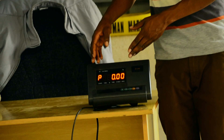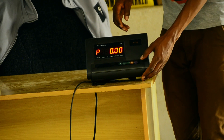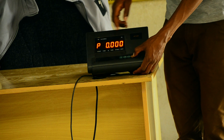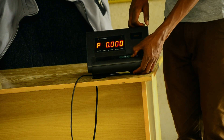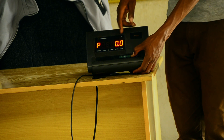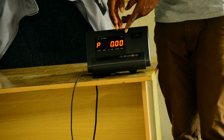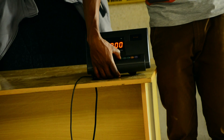This gives you the number of decimal points that you want. You can change this by pressing the tare key. As you can see it is 0.00 — you can change it to 1, a whole number, 1 decimal point, or 2 decimal points, that is 0.00. We are going to calibrate at that point, then you press the hash key.